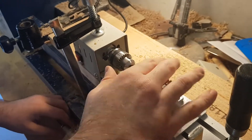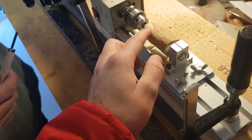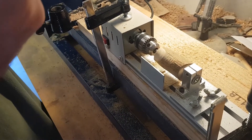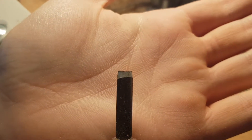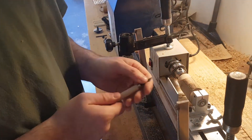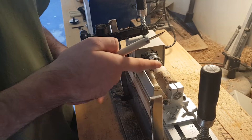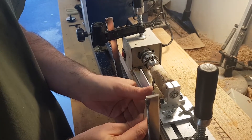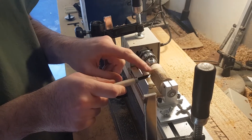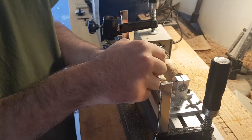It's just cutting loose and I'm not sure why, but it's actually working quite well. I imagine we'll get blunt very quick but it hasn't done a terrible job — in fact it's gotten pretty messed up already. Let's try a different tool — going for the skew, which I have a feeling is going to snap pretty quickly. The notch they've left in this tool rest where the screw goes in does not go in anywhere near far enough. I'd like the tool rest to be closer — because if you leave a huge gap there, that just allows the tool to snap.